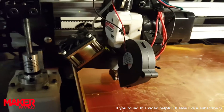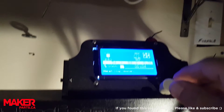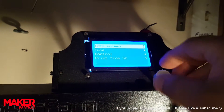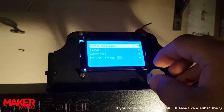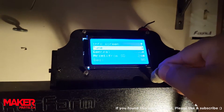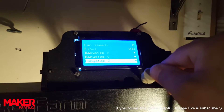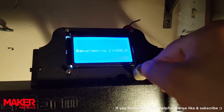I'll show you how to do that to get this thing flowing. Come up here to the menu — you get into the menu, then go under Tune. The Tune menu only shows up after the print has started. So go to Tune, then all the way down at the bottom under Baby Stepping Z and go into it.